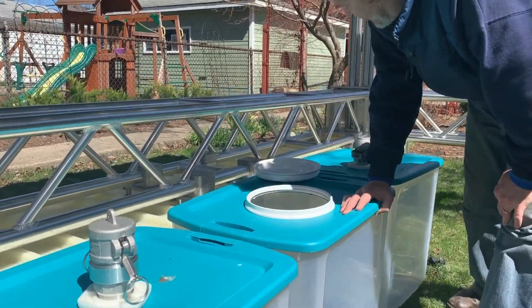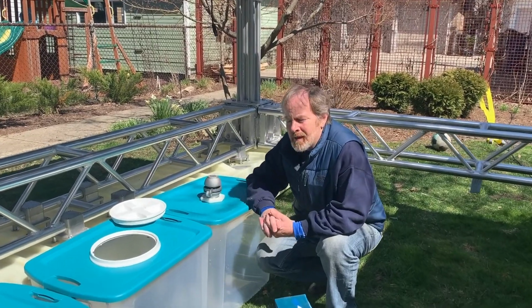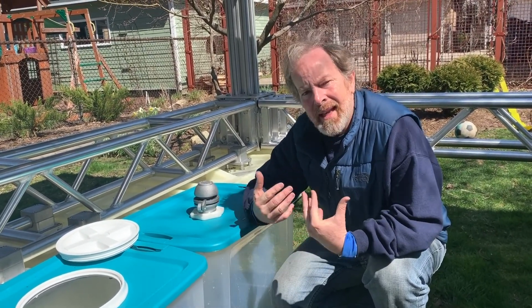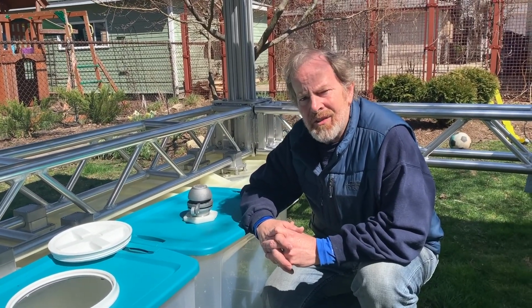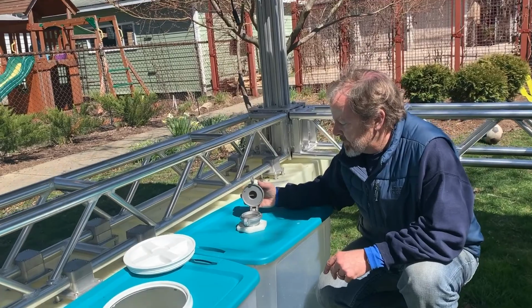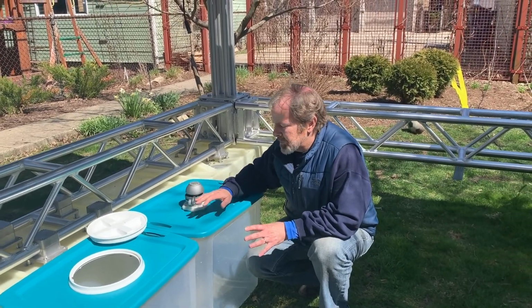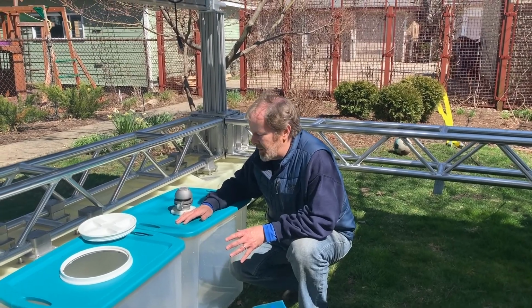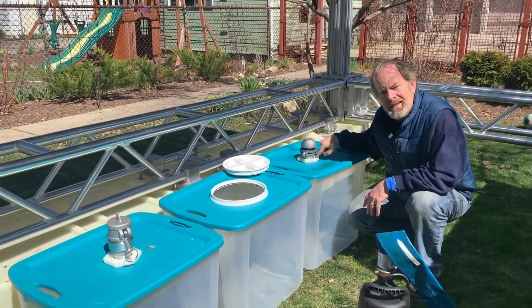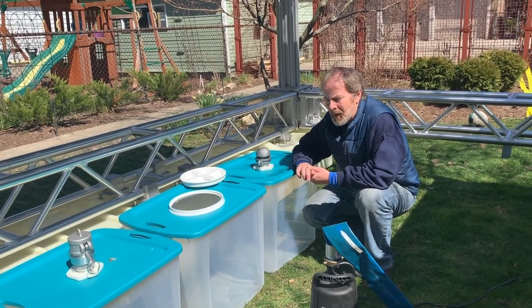The last opening I want to show you today is this idea of a vent. And we know that although the tank is strong, it's not made to withstand pressure like a pipe. So it can't go into negative pressure or positive pressure. It's just not designed structurally to do that. So we need to be able to have some sort of vent here. And the vent that I have here can serve two purposes. It can let air in and out of the tank while still protecting the ballast from evaporating at a large scale. This is lockable also. The other thing is we're thinking both these fittings can occupy the exact same opening. So in that way they're almost reversible, so that we really limit the number of pieces and parts that we have on a tracker sled.